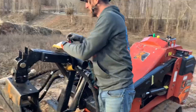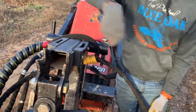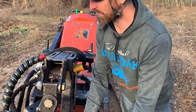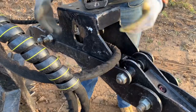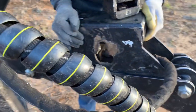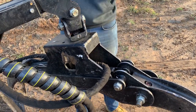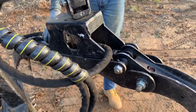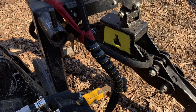When playing with the grapple, we don't want it to rotate too much. I have a little cut-out on this side where I had it plasma cut to get a tool in — I wish they'd come up with a better design for accessing the hoses, because it was really hard to get a wrench in through their logo. Anyway, this cut should be facing the operator. If it's not facing the operator, your hose is twisted — you need to let the grapple untwist, otherwise you risk breaking a hose connection. Shortly after shooting this video, I decided to paint that surface yellow so the side that should always face the operator is an obvious yellow.